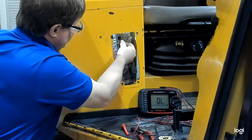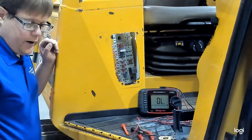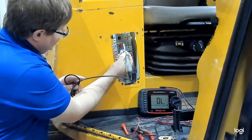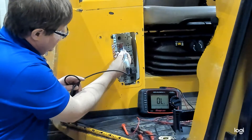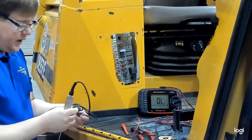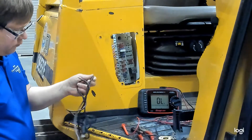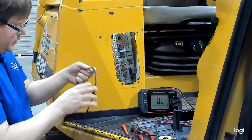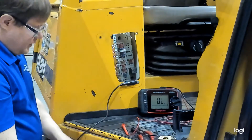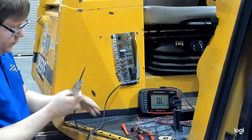That can be a little tedious depending on the size of your fuse panel and how many fuses you have. Another way to test fuses would be to use a test light. Each fuse has an opening on the back side of it with a little portion of that metal tab sticking through. Make sure you select the right voltage test light for the system — this is a 12 volt system on this machine. You're going to want to attach the lead to a good ground, and the circuit needs to be powered when you're testing it to be able to tell if you have a good or bad fuse.